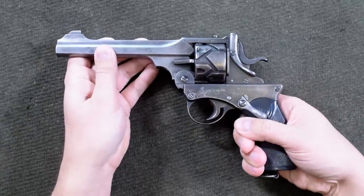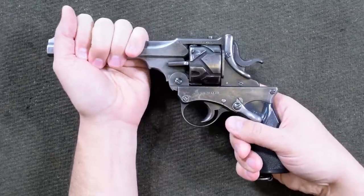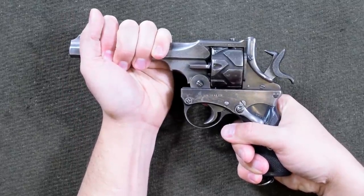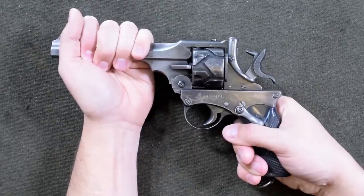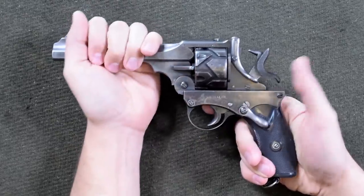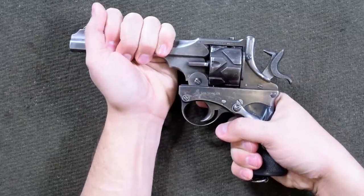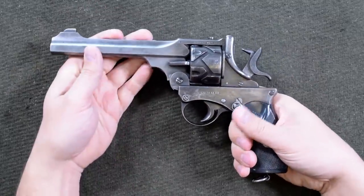So you would hold it. The barrel and upper assembly would want to go rearward while you held still. And then boom, that recocks the hammer and the spring inside the grip drives it forward. You can see the rotation of that cylinder. So then you would fire single action again, boom. And then click, click. Okay, is that making sense?